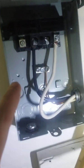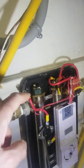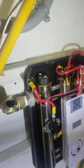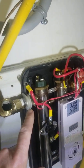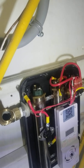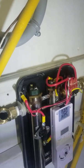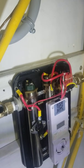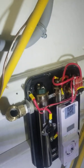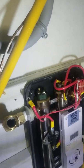I took off the wires. I actually have the circuit breaker off and a disconnect pullout. I started to crank on that top nut, which is supposed to allow me to get the elements out, but it really started warping and bending things. If I did that every year it would probably cause something to break. Plus, if I put it all back together, would it leak? You'd need new O-rings. The problem is having something to grab onto with one wrench while gripping the nut head with another, so you're not torquing on the unit that's mounted into a plastic base — something's going to give.